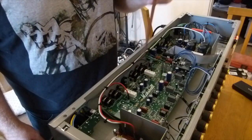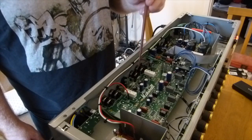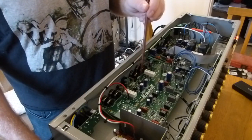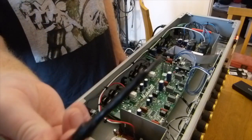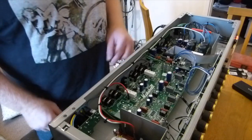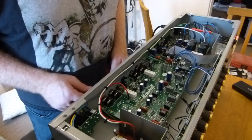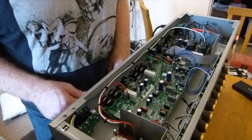There's a nice connector there. You put your probes on there. Negative or ground goes to the middle probe, and then your two outer probes you use for your red wire. And then just adjust those pots. Again, a nice light screwdriver that's insulated, just the smallest amount showing at the ends. Disclaimer: do not try this at home unless you are absolutely sure you know what you're doing, because you can kill yourself basically, and nobody wants that.